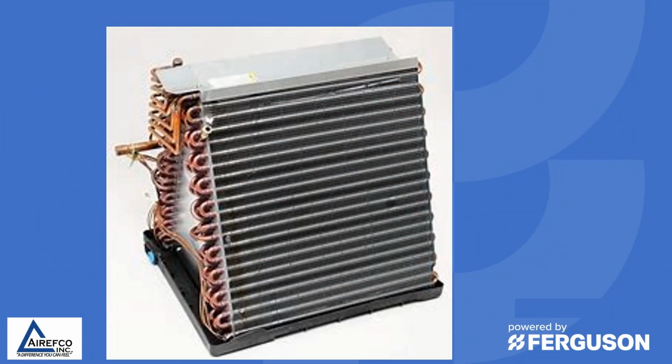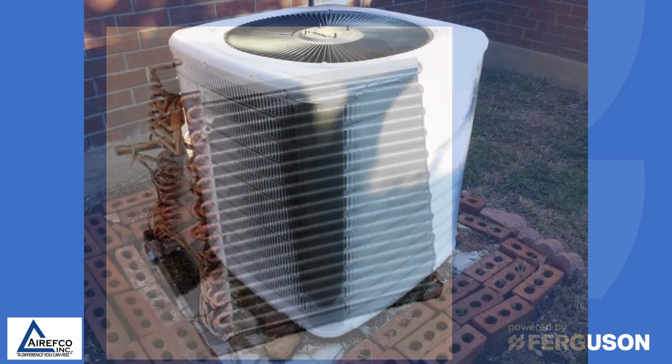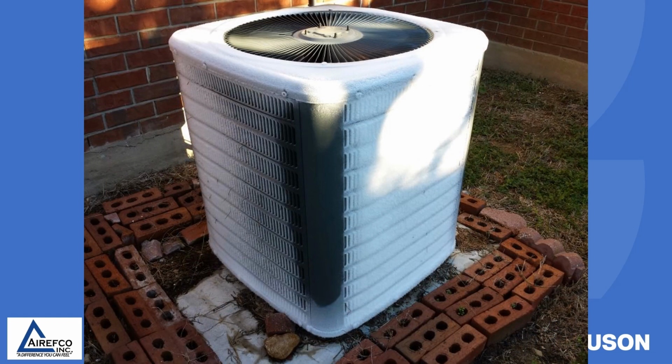So in this video, we're going to talk about evaporator coils and what happens when ice forms on these coils. On the outdoor unit on a heat pump system, it's normal for ice and frost to form on the outdoor coil because heat pumps operate in temperatures below freezing, and so any moisture that collects on the outdoor unit will of course freeze. That's why a heat pump has a defrost mode to clear this ice that forms on the outdoor unit.